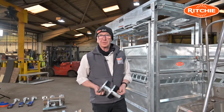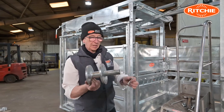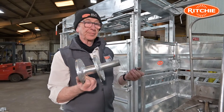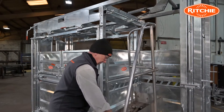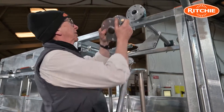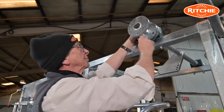Next we will fit the squeeze handle extension piece. This unit comes with four 12mm bolts. We will access it again from here, bring the steps back a little bit, and this unit slides into place and we tighten using these bolts.